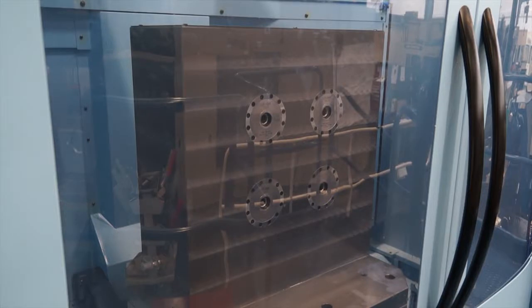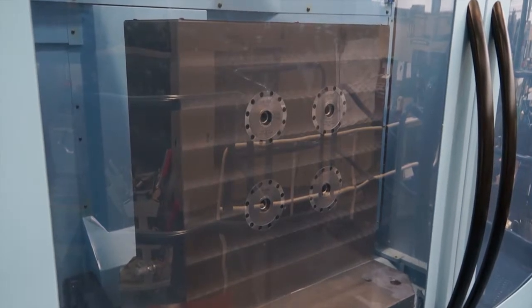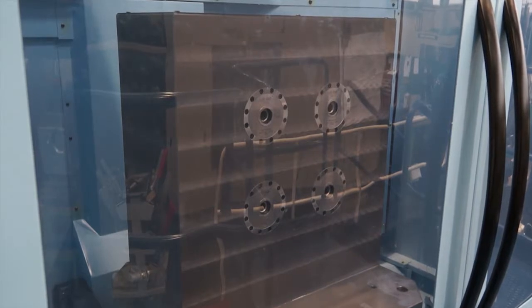So it's bigger castings that you're machining on the H100, but I noticed this fixture plate here. What's that for then? Smaller ones? Yeah, if we're not running a large casting, it does give us the opportunity to run a number of smaller castings on the fixture, so that we can keep the machine running and give us a much more flexible capability where smaller castings are concerned. So when it comes to fixturing, you'll make your own fixtures for some parts, but you'll use things like the VB dock block for more modular stuff. Yeah, we do make a lot of our own, but for something like this, we would buy a purpose-made set of fixturing from a known supplier.